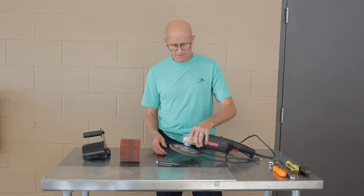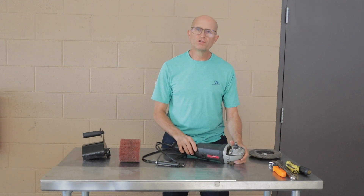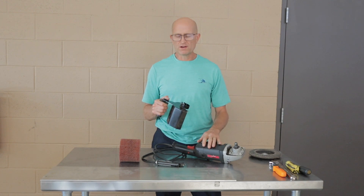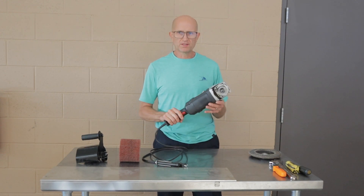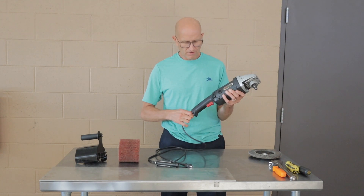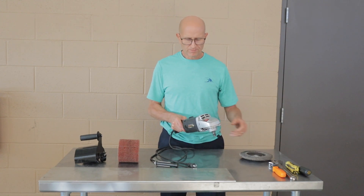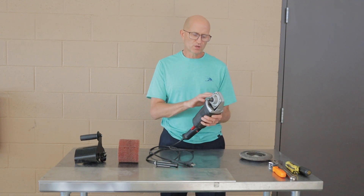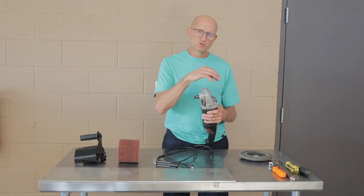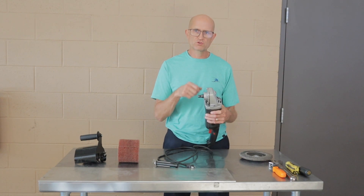What you're going to do is take off your flap wheel or whatever grinding wheel you're using at the time. First thing we have to do is orient the grinder. If you notice when you look at the Eastwood SCT it's offset 90 degrees. When you get your grinder from Harbor Freight it's oriented for standard grinding, but when you turn it sideways your buttons are on the side. So the first thing we have to do is reorient it — just loosen the four screws, break it loose with a screwdriver, rotate it 90 degrees, and re-tighten.